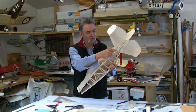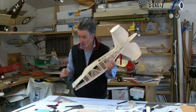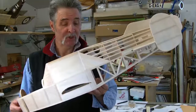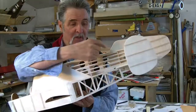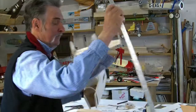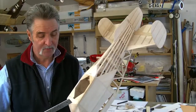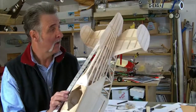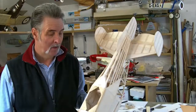The lower part of the frame I've used a simple quarter square box with the old Eiffel Tower effect. This is a very, very strong section down there. I used a profile piece going through the fuselage, to which I attached the formers to. Now, I'll point out one interesting thing - I think it is correct, which I haven't got right on this. The fuselage should taper back on the top from the top front of the windscreen all the way back to the fin. I believe it should taper back like that to the centre line. I haven't got this correct - I've still got a bulge there, but I'm going to live with that.